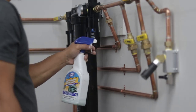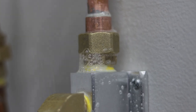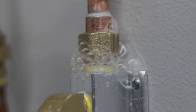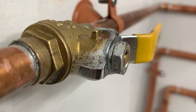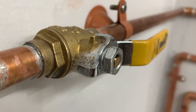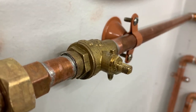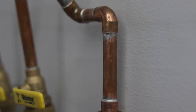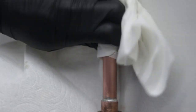With the system fully soldered, I opened up the valve at the air compressor to check for leaks. Using soapy water, I found two areas where it had leaked. Almost all the unions leaked, which I sort of anticipated — I wanted to see if I needed to seal off the threads or not, because theoretically they are supposed to be sealed at the face. The second area surprised me — the leak came from the screw handle of the ball valve. Once I added tape and sealant to the leaking unions it was fine, and for the valve I just torqued it down a bit. Last but not least, to give it a clean look, I sprayed some WD-40 on a Scotch-Brite pad and cleaned up the pipe. Not necessary, but it gave it a professional look.